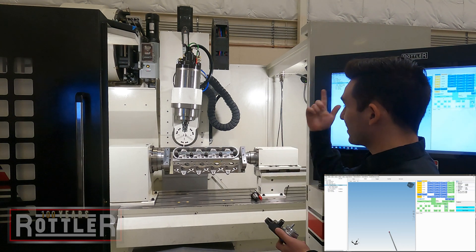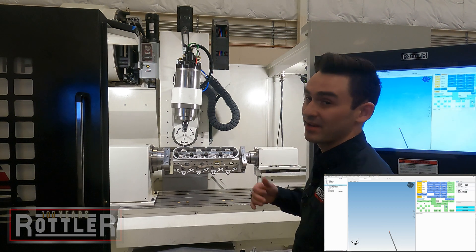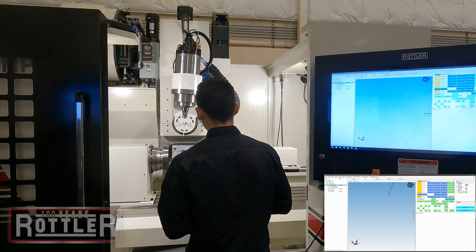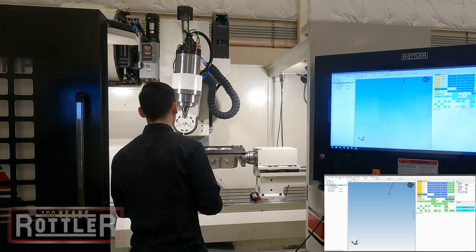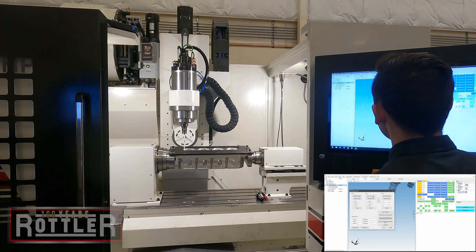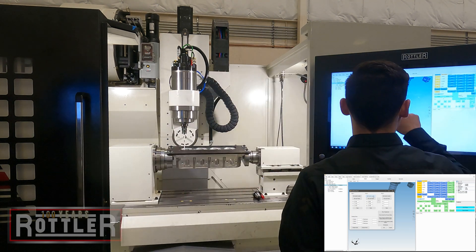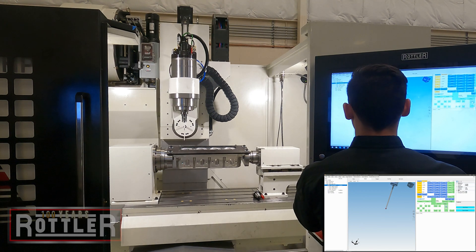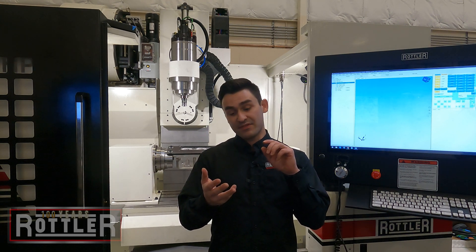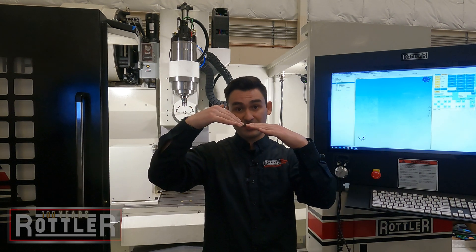Over here we have our Vector Z button. When you're down in the port at an angle, if you just move up in Z it's at an angle, so to retract the tool along its vector I use the VZ+ button — it helps get out of the port a lot faster. Now I rotate over and do my last one, which is the seat side. I eyeball what's facing up on the seat side, make another plane, and that gets the seat side. So now I have three main sections: the manifold, the seat section, and our dividing section in the middle.